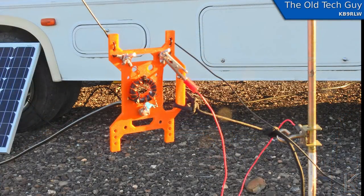Here is the feed point of the antenna. I drove a ground rod in — I wanted to drive it in all the way but I kept hitting rocks. The soil here is full of big rocks. I tried five different spots and couldn't get it down more than about half a meter or a foot and a half. So it's not really acting as much of a ground rod, but I did clip onto it with alligator clips. Scanning the antenna with and without the ground rod, the scans didn't change hardly at all, so I know it's not acting well as a ground — it's just an anchor point.